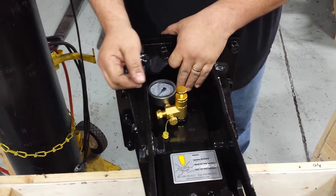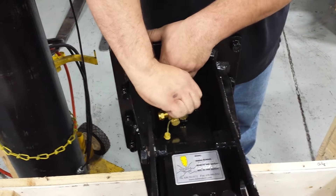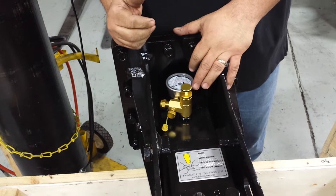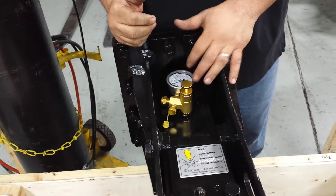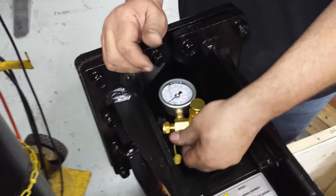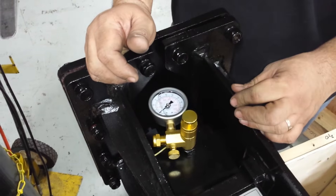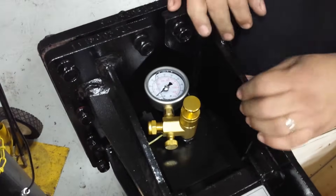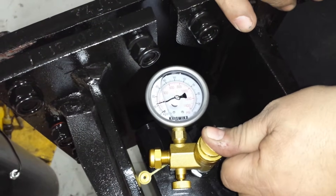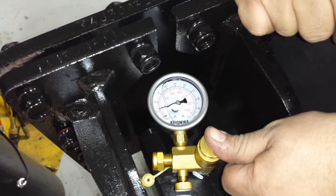What I like to do is hold the charger over to one side, snug it down as much as I can by hand, and then have it walk or follow me so I can get a nice additional snug on it. You don't want to use any tools because you're going to end up damaging the aluminum housing on the charger. Make sure the thumb screw is tight so you don't lose any gas, and make sure this cap is tight as well. Simply push down on the plunger. We want 205 to 235, and we're under 200 PSI — so obviously this breaker will require a gas charge.